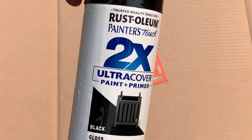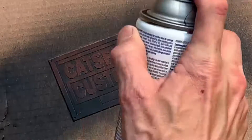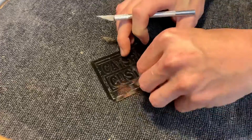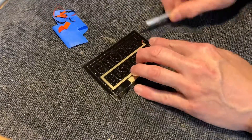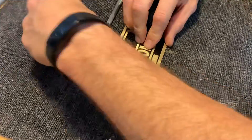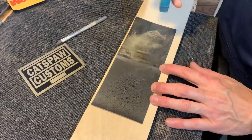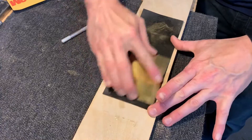A light coat of black spray paint is all it takes — there's nothing special about this type, it's just what I had on hand. After the paint had dried I very carefully removed all the remaining masking vinyl from the brass. I also did one more polish with the 800 grit sandpaper. You want to do it like this to avoid accidentally sanding through the parts that had just been painted.